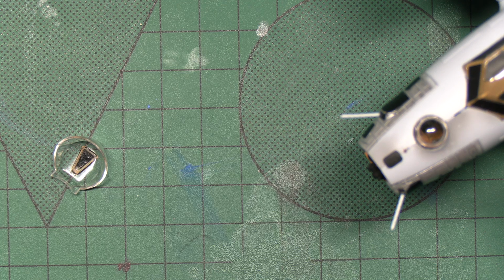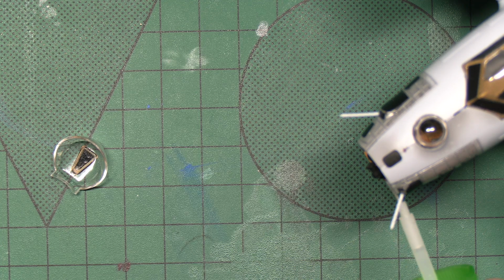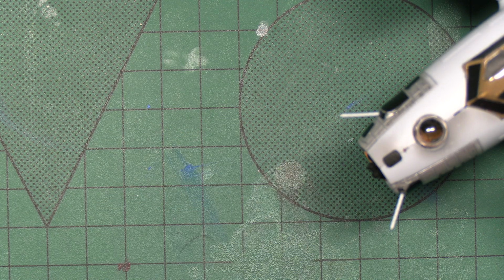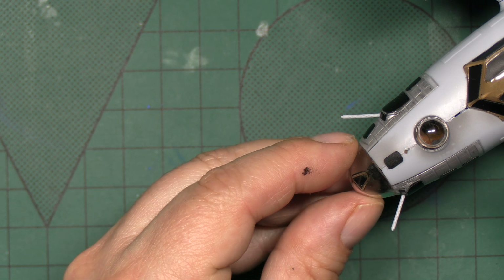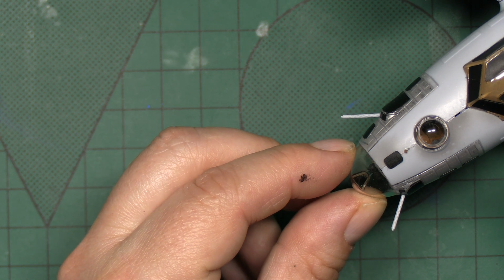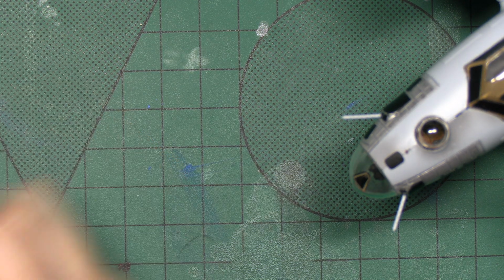If you've been following my channel for a while, you know that this is a trick I do quite a bit. So that second layer of glue will sit on the surface much longer without flashing off than the first. So we've basically got a sticky surface there. So we're not putting glue in the gap and letting it capillary in. We're going to place the part on, and it should hold and bond with no risk of getting any gassing or any issues like that. There you go. Nice and clear. All good.